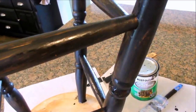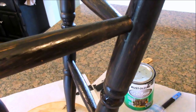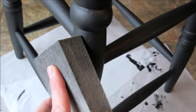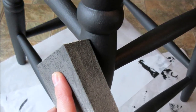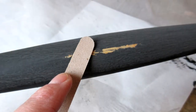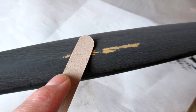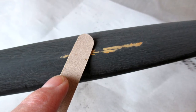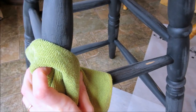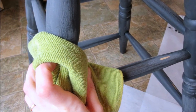Once the stool was clean I gave it a light sanding and a first coat of paint. After its second coat of paint I gave it a very gentle all-over sanding to remove the brush strokes. When it came time to distress the stool I found that the sanding sponge wasn't gritty enough, so I resorted to a fingernail file, taking care not to remove too much paint. Now it's time to remove the dust from the entire piece by wiping it down with a lint-free cloth.